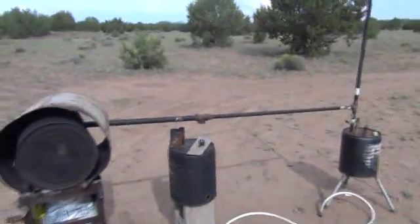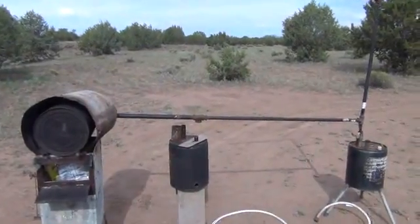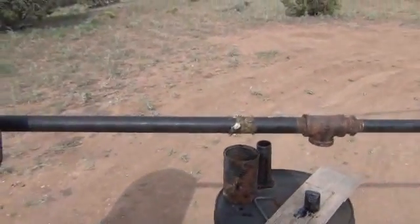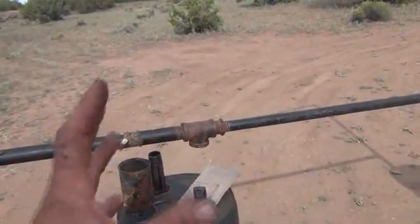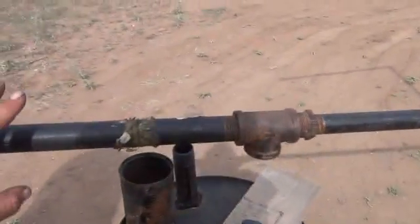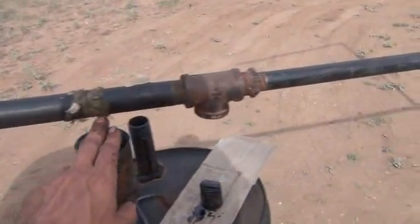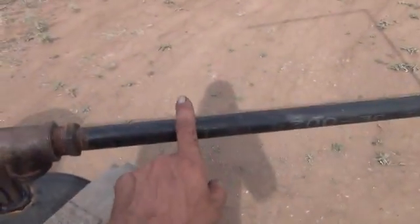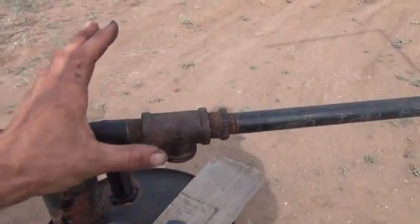Let me back up and show you why it's working this way. If you notice here, there's a downward slope to that pipe going through there. It's working opposite of thermodynamic pressures. What that's going to do is actually force the smoke to release as much of this crude as it possibly can, because it's actually wanting to go uphill, which would be easy. The smoke's not going to cool real quickly. By forcing it slightly downhill, we're forcing a lot of that heat energy out, making sure it's releasing a lot of that creosote or bio crude. It also allows the creosote to roll down the bottom of the pipe, hit our T-block here, and run down into our first collection container. It goes into a smaller point — a reducing point right at the capture point — which helps restrict the pressure and focus the cooling for our first capture.